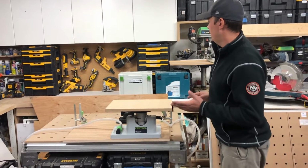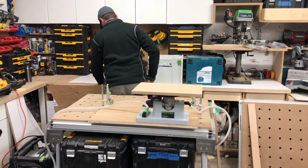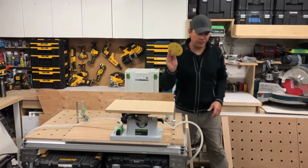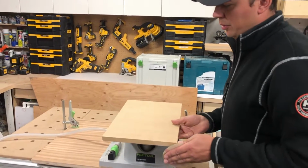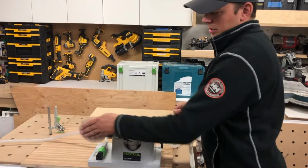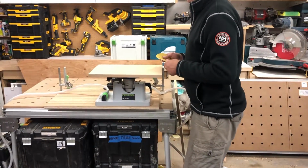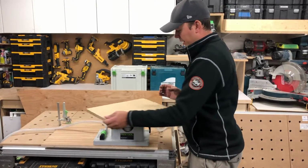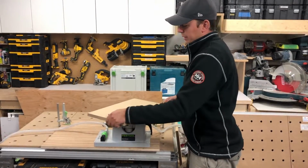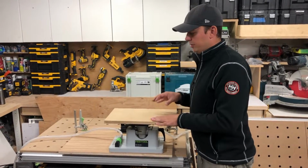So why is it cool? Well, because if this is a door, and just grab some sandpaper, but let's say I gotta work on it, I can work on this, no problem. Rotate to this side, work here, then I press the foot pedal, flip it over, do this side, or if I'm, say, using my router, I want to router all these edges, I can just stand here and router around the thing. It's just such a handy clamp to have if you're into fine finishing.